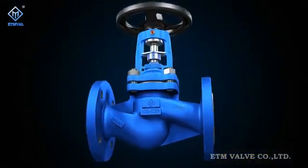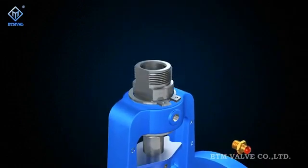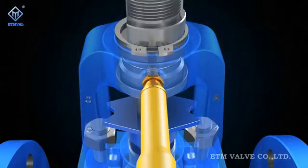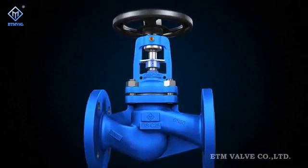For Figure P series, the stem nut is retained with a circlip and has the feature of storing lubricant. This design ensures that phenomena such as nut break-off, seizure, and abnormal sound during the valve open or close cycle are totally avoided.